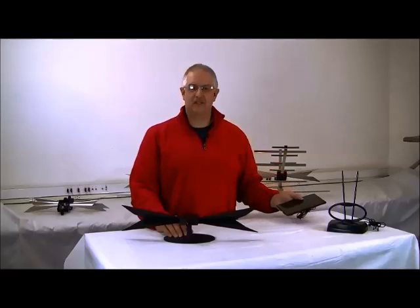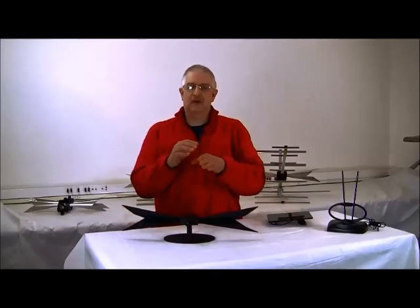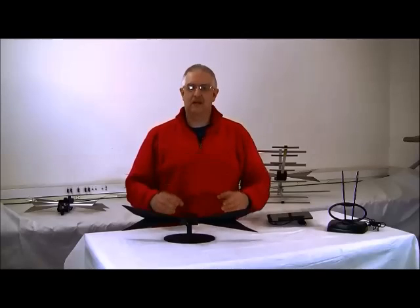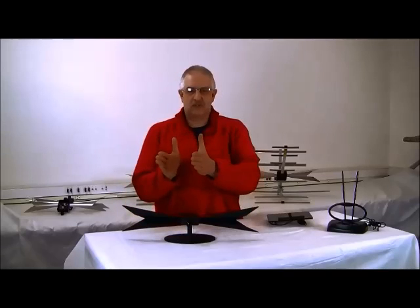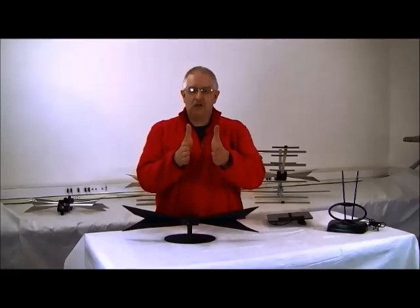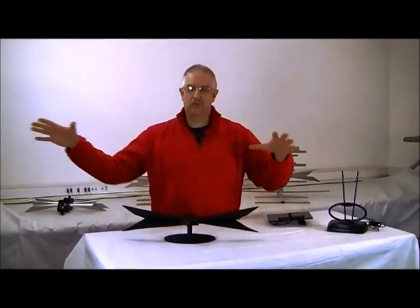There are flat antennas with a configuration similar to an arrow. This provides minimal directionality and gain and they are primarily UHF antennas. The arrow has to be pointed toward the signal direction. If broadcast signals are all from one direction, it works fine, but if they are from multiple directions, channels will not be received and picture quality deteriorates.